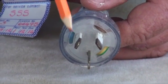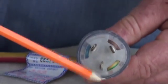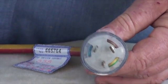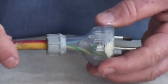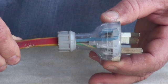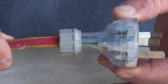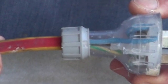Also check that the unit itself is secure, that it has no frayed bits, no burn marks, and that the collar of the unit is secured to the socket outlet with no insulation showing. At the joining end of the plug, inspect that there is no inner insulation or coppers to be seen and it is tightly anchored together.